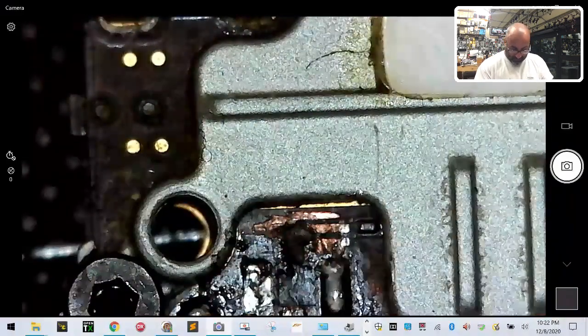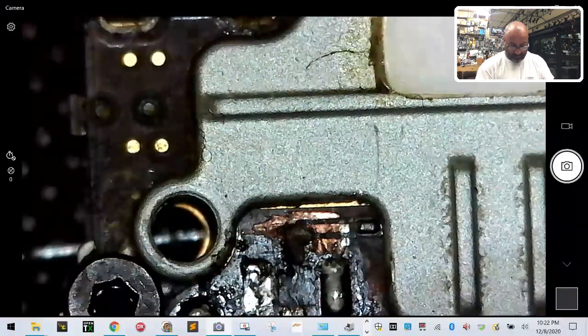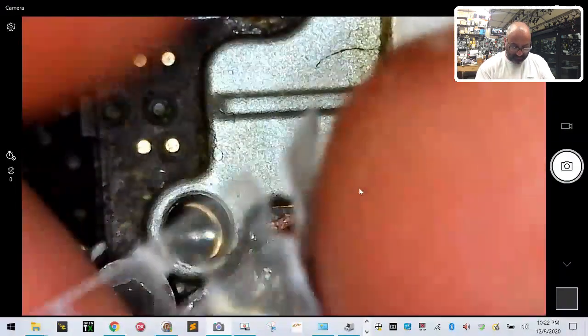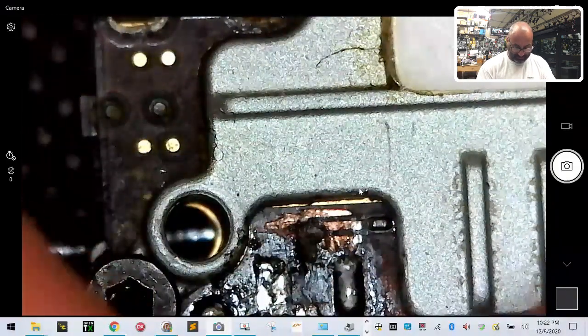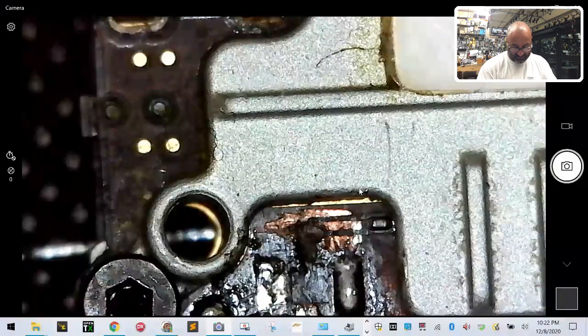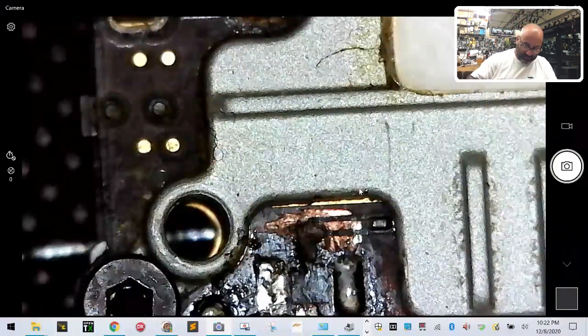Okay. So what I'm gonna do is take this UFL out here. Try to do it without damaging it. Here, so you can see where it is. It's in these pouches here, right? Because the machines that do this remove these automatically and then place them on the board. So we have to do what a machine does, but try not to screw it up at the same time. All right. Trying to peel this stuff back without damaging the UFL. I'm just trying to be very careful about it, but it's not working as quickly as I thought.